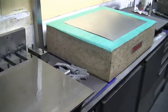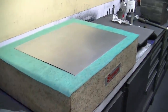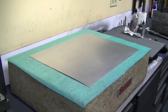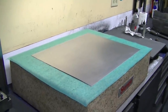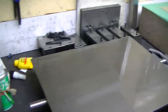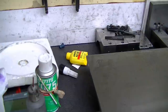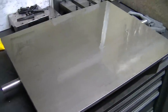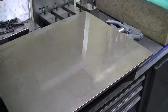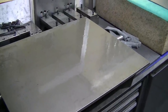I also have to spray the 7075 activator onto the aluminum and give it 3 to 5 minutes till it wets. It's actually kind of unusual. It kind of gleams up and gets a greasy look. Both these, the activator and the 325, are excellent for oily surfaces. Very, very tolerant of surfaces that aren't degreased well. It's not the case here, but with anything iron, iron has a tendency to hold things in its porosity. So it's a good choice of glue. It's a good tough glue, and it's resilient, but still rigid.